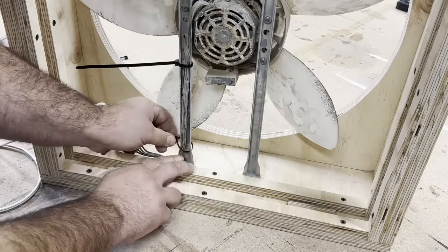I realized I made yet another mistake. When putting this piece on with the piano hinge in between, the biggest problem is that in the open position, the filter no longer fits in the groove. So I need to take about an eighth inch off all the way across so the thickness of the hinge recesses back into the housing and allows the filter to pass in front of it. To figure out how much to take off, I opened the hinge and marked it with a pencil, then used the table saw to trim it down and a flush trim router bit to fine tune the cut. Then I tested the filter one more time and used a self-centering drill bit before installing the screws.